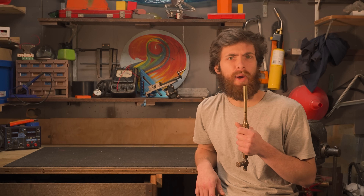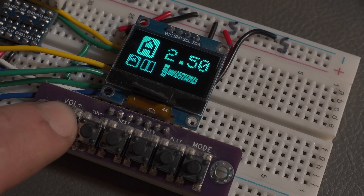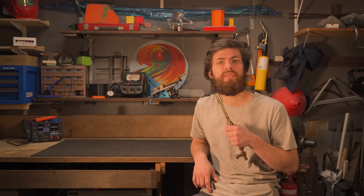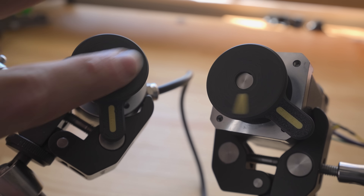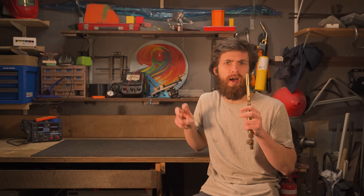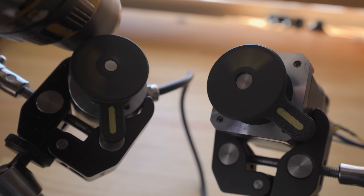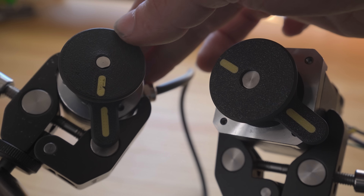Because for some reason, apparently, those are bad. The ratios for all the threading and feed pitches are stored in a couple of arrays, and with a couple of buttons and a handful of luck, I should be able to cycle through them at will. And this cute little display will let me know what pitch and gearbox ratio I've selected. So with all that out of the way, I had some code that should be able to convert the encoder pulses from the spindle to motor steps for the lead screw flawlessly and in real time. But once I started testing — and no, you don't get any points for seeing this coming — that was pretty obviously not the case.